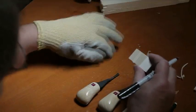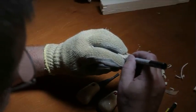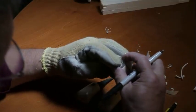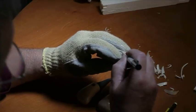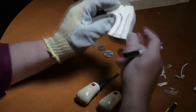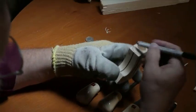One way also to carve then the bottom is using the same coin to make the toe. You'd simply hold the coin down there and take your pencil, make a curve on the toe, and to round the heel, you do the exact same thing. Hold the coin on and make a nice circle. So then you have the bottom laid out, and you have the sides. And this dimension here is the same as this dimension here. Makes rounding it much, much easier.